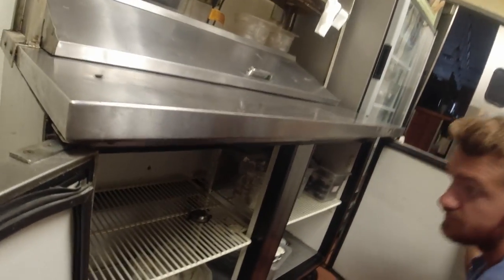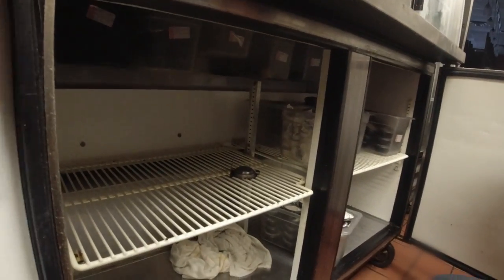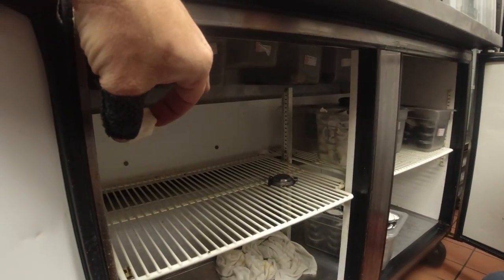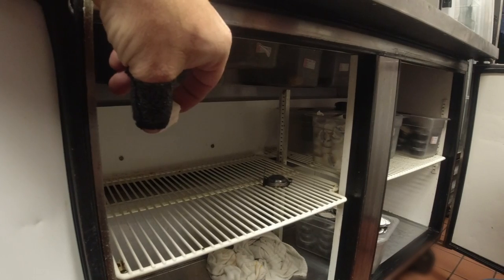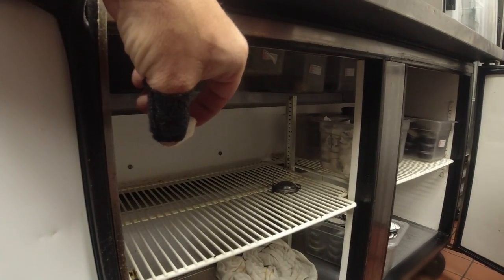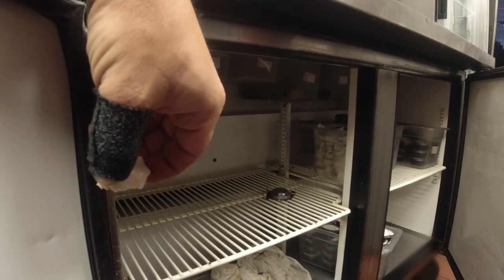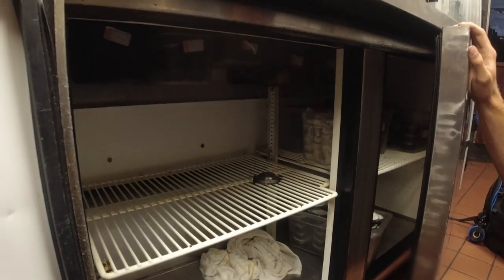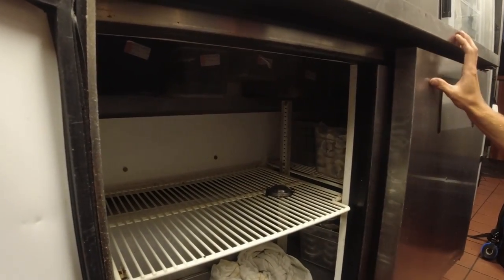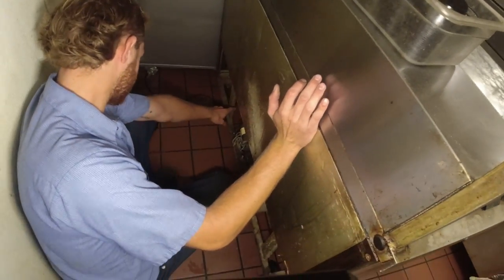The pan is right on the very bottom. There's an aluminum piece with screws on the front - pop that up and you can get inside to see the pan, or pull it out and check the backside for any water in the drain pan. See if the hose is clear - it may just be plugged up. I noticed we're frosted up on the suction line.